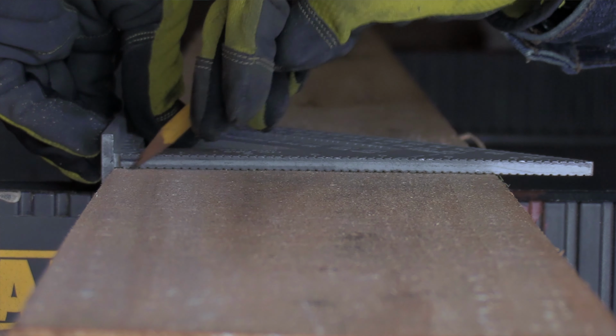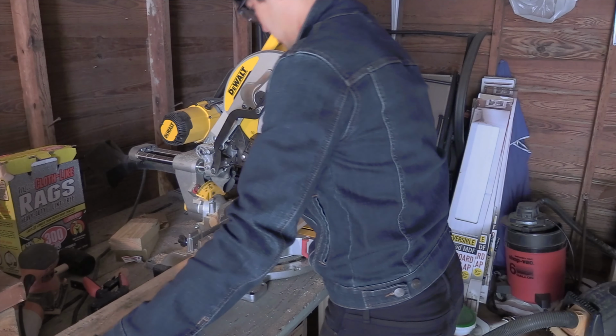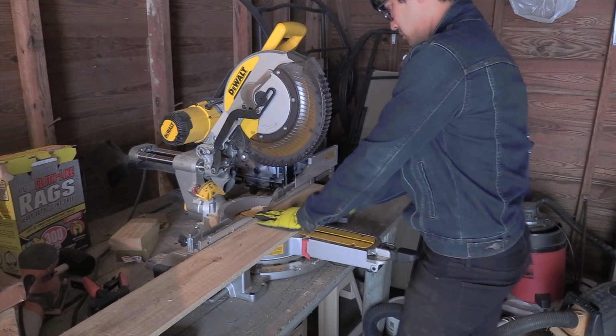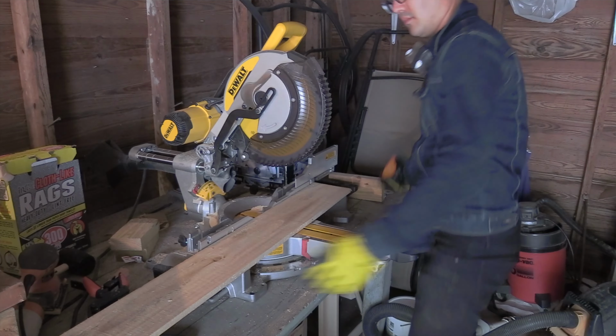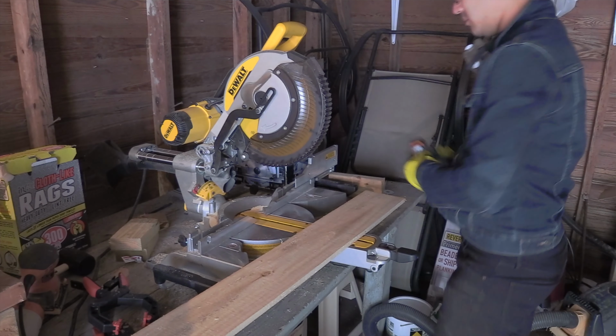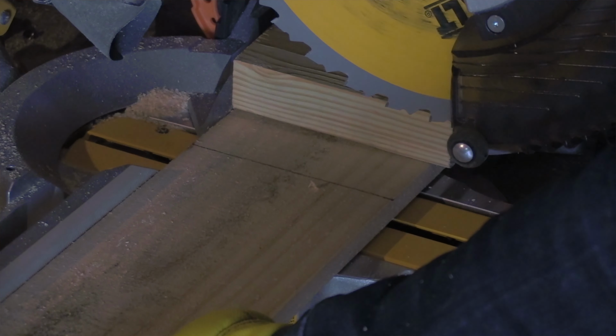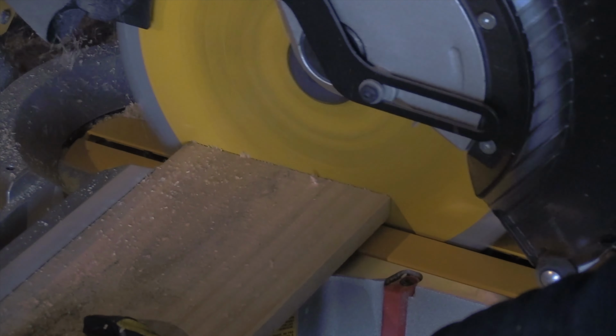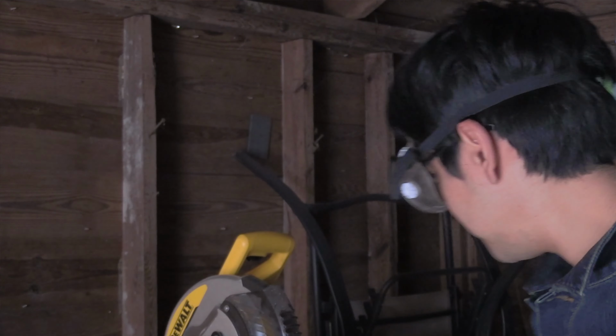I'm going to start out by cross-cutting the wood to the correct sizes for the box. I'm using these really cheap fence pickets. They were like $3 each. And I'm using my miter saw, but you can probably do this with a jigsaw or really just by hand if you're not as lazy as me. Oh yes, always use eye and ear protection when you're doing this.